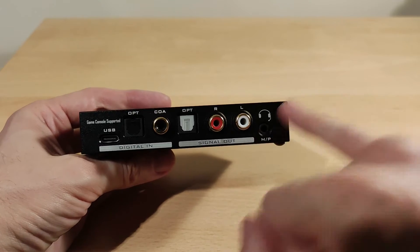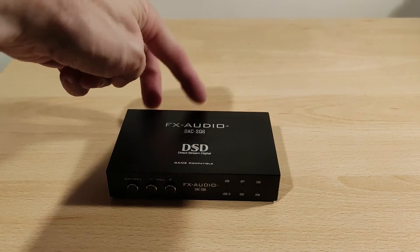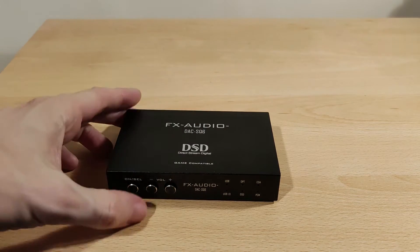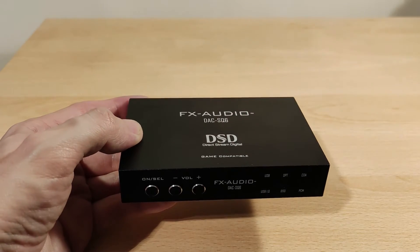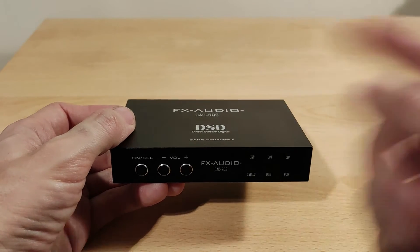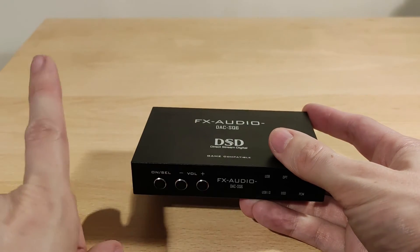The headphone jack being on the back is one quirk — that may or may not suit your setup. Regarding the RCAs: you can leave the RCA cables in to feed another amp, but if the headphone jack is also plugged in, the RCAs don't work. The headphone output takes priority. Once you unplug the headphones, the RCAs become active. However, this is a pre-out, not a line-out — so it controls the volume at the back. In my test with the Topping L30 amp, I had to push the volume quite high to match my E30 DAC, but as soon as you switch to headphones it's super loud.